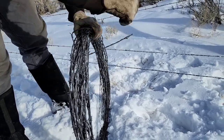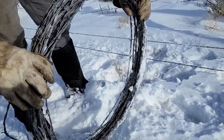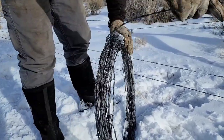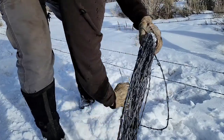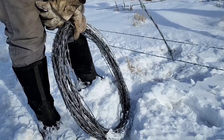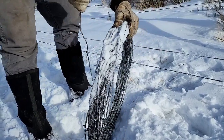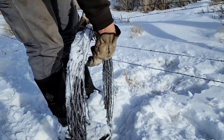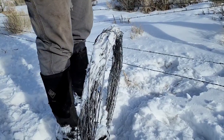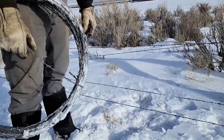However, there's another alternative way of doing it, which involves leaving a little bit longer leg coming off that barbed wire. Go ahead and flip that through there, wrap once around the top of that, and you should have enough length to go down to the bottom of the roll and do that exact same thing on that side of the roll — just one little curl. That's pretty close; it'll still work. That is one way of rolling up barbed wire by hand and securing it so it doesn't come undone.